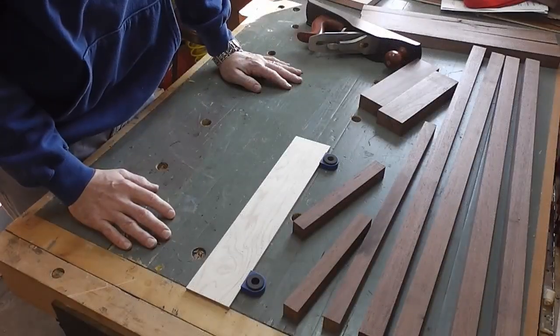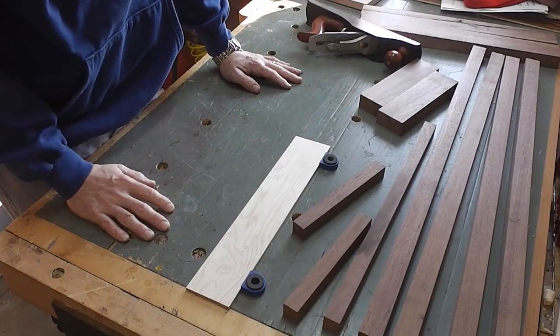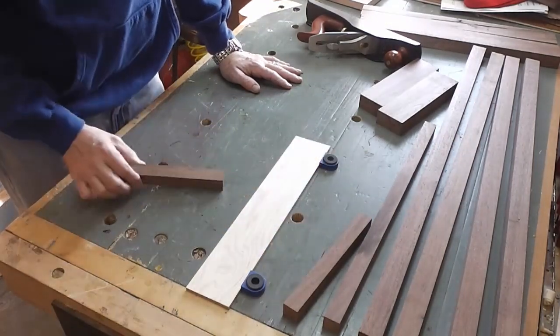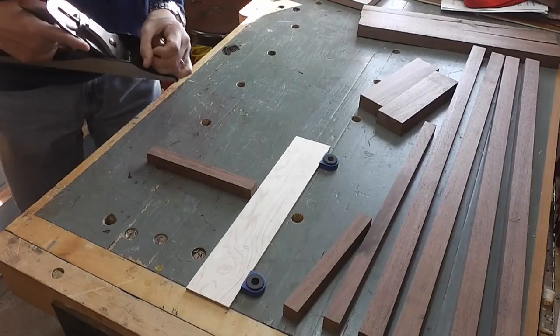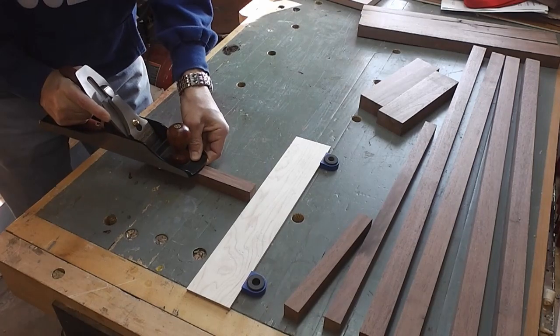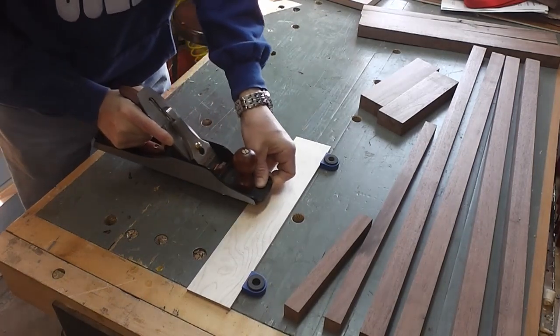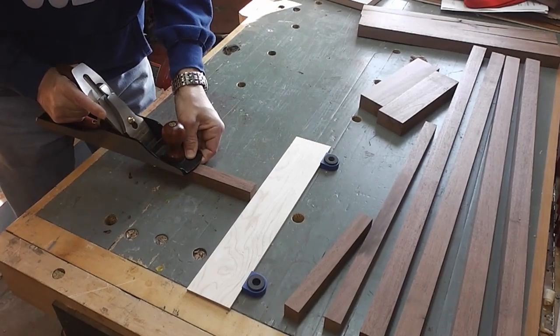Here are all the pieces for the base of the cabinet. All the pieces are fairly small, so I'm not going to bother sanding them. I'm just going to take a hand plane — I've got a simple planing stop set up and my plane set for a very light pass. I just want to take these machine marks off, and with one or two passes they'll be ready right for the finish.